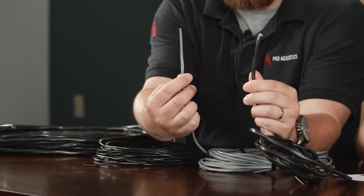That's a huge difference. We don't really want to run that much cable whenever possible, but as you can see, it matters a lot what gauge you use. For most of our 70-volt applications, you're going to find us using approximately 16-gauge, maybe 14-gauge — somewhere right in the middle between 12 and 16. Even though that wire is skinnier, it can still handle much more wattage in a 70-volt system because of the nature of the electrical signal itself. So with a 70-volt system we can use 16-gauge and 14-gauge to run longer distances and more wattage, as long as we're using 70-volt speakers.